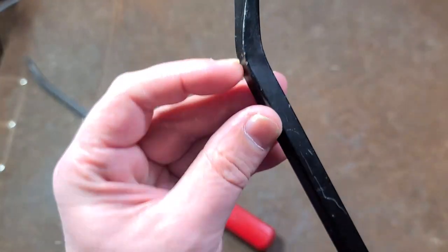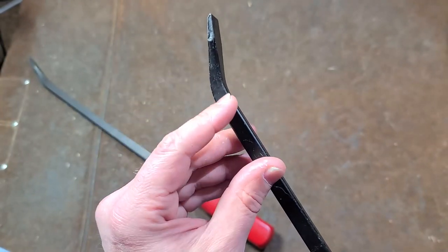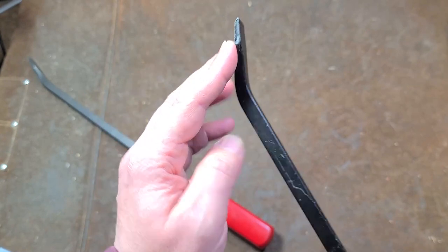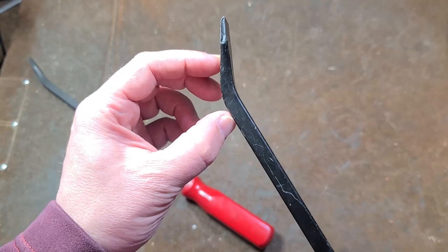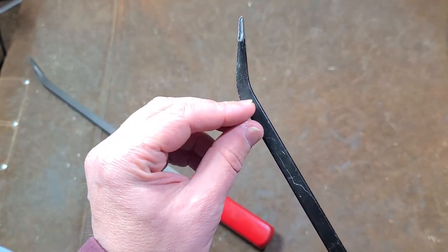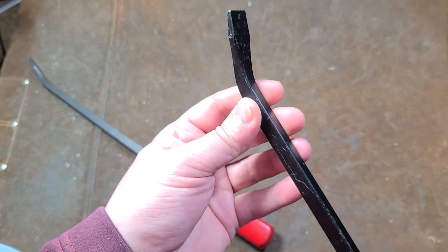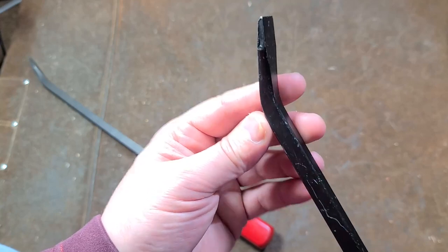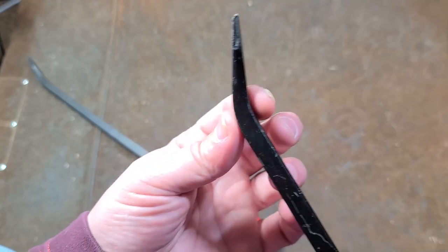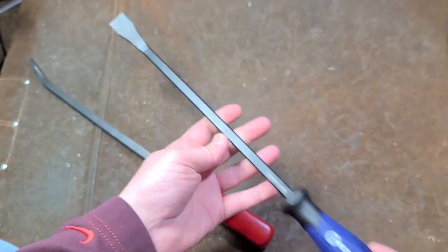What that does is actually causes additional stretching in the material and can weaken it just a little bit more than if they had made the bend just a little bit longer. They could have still had it at 25 degrees, just not pinched it in the break — if they had rolled it or used a round bar to make the arc just a bit longer so that no specific point of the metal was getting stretched. That was actually surprising because it's pretty rare for a pry bar to suffer a failure or bend right at the offset. Usually it's in the middle of the bar.